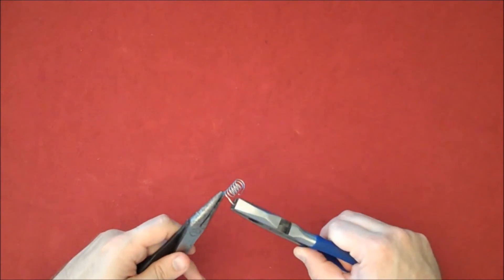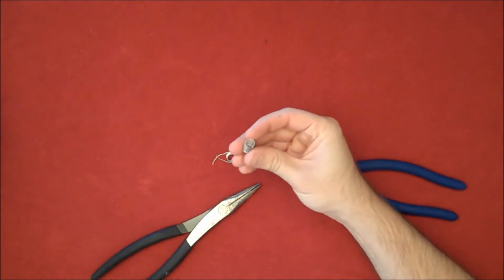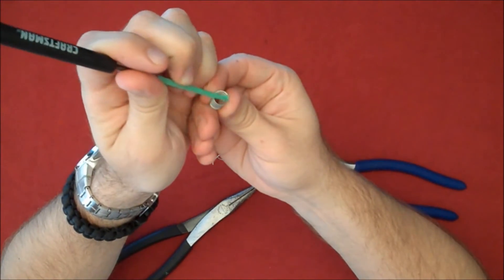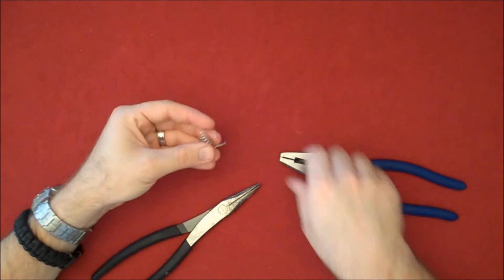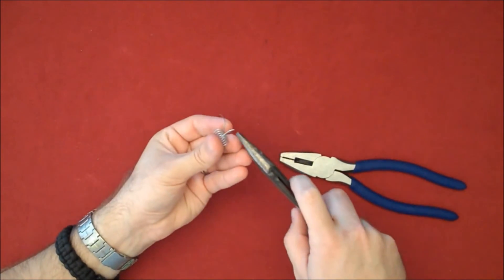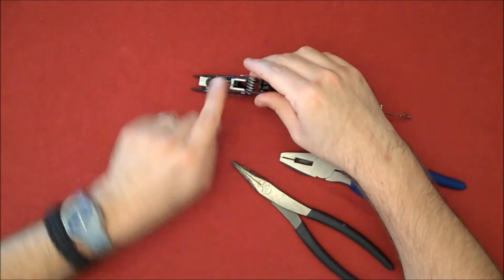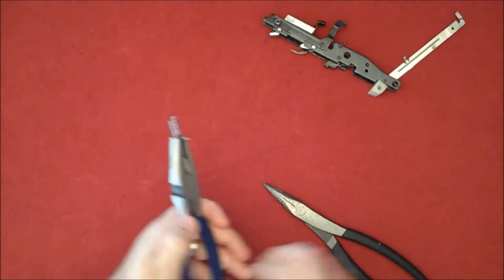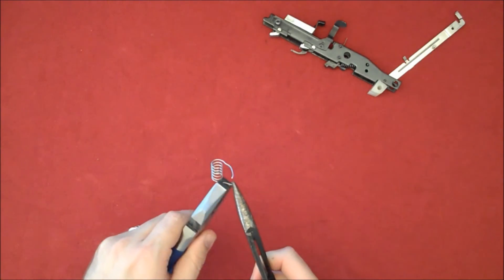Keep grabbing and bending out — that's pretty good for both sides. Another important thing to note about these springs is that the spring must have a counterclockwise wind. Here's the spring after I cut it — if you look at this free end and follow it, it goes in a counterclockwise way. That's very important; a clockwise wind will not give us the tension where we need it. While you're here, you can bend the short end back a little bit forward so it'll really engage and lock in there easier. It's easier to do this bending before you put the spring on because then you don't have a lot of room to work with.